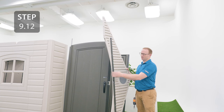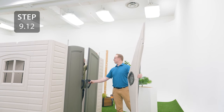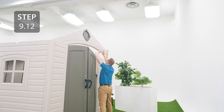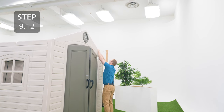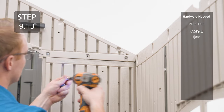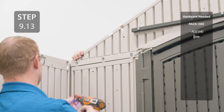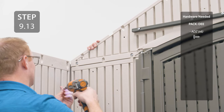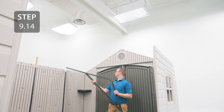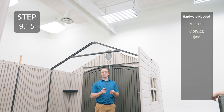Close the doors and place the larger gable that has a curve at the bottom onto the hinge tubes. Line up the holes in the gable with the holes in the corner panel and then secure with the hardware. Add a truss assembly without a notch into the cutouts closest to the gable, using the same method as the opposite side.